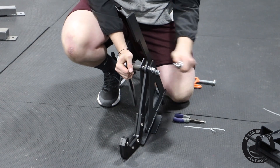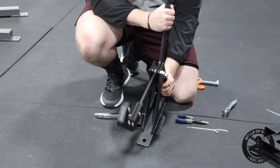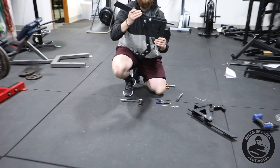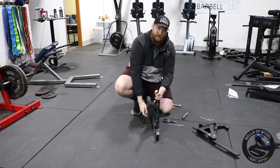Especially with the monolith attachment, we're going to tighten it just snug and that's it. Because otherwise this lever arm won't move if the bolt is too tight. As you can see, I over-tightened it so it's not going to fall as smoothly. I'm going to take it back a half turn.